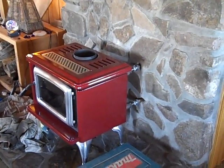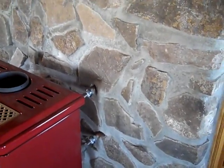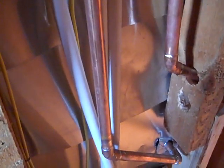This is part two of making hot water the old-fashioned way. Part one, I put the coil in the stove, and now the coil is connected to copper lines hammer-drilled through the rock and masonry. We're having to redo the double-wall chimney pipe, so that's why the chimney pipe's not connected now, but it will be shortly. You can see that little rust-colored range boiler is over there. What we're having to do is plumb in cold water, and then we have the hot water coming out of the tank.